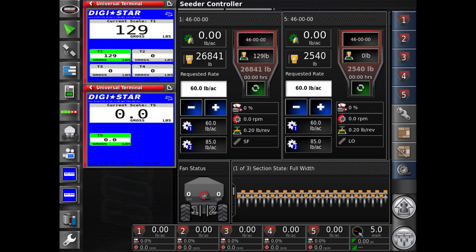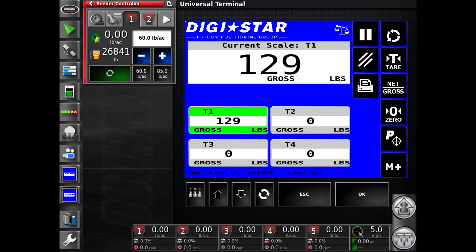We will look at some of the functions of the Digistar UT. Slide the mini view out into full view. The 9000 air seeders do not have the Digistar display mounted on the tank, so some functions must be accessed through the UT. To zero the weight in a tank, it has to be done in this screen. The tank that is highlighted — T1 in this case — is the one that you affect. Holding the zero tab for three seconds will zero the selected tank. Then you can move on to any of the others you would like to zero as well.